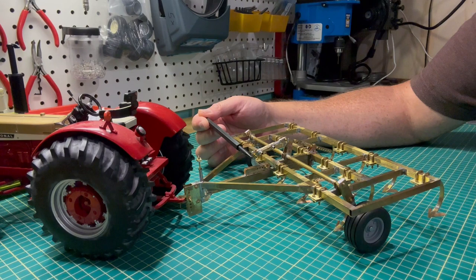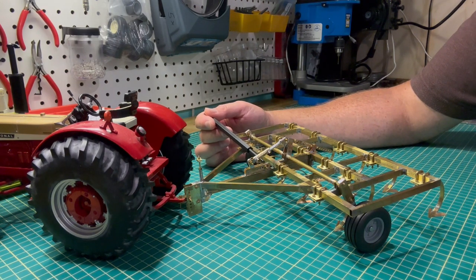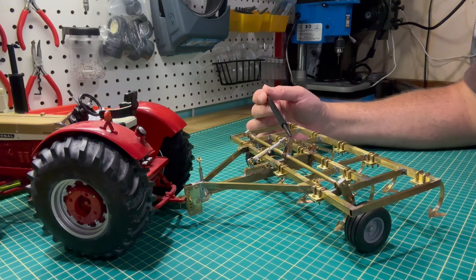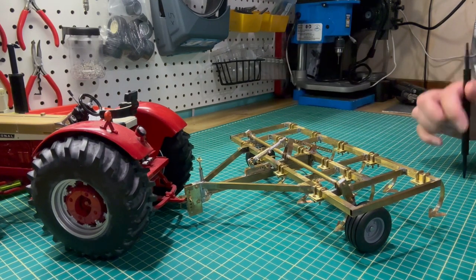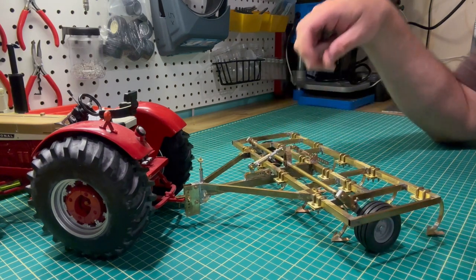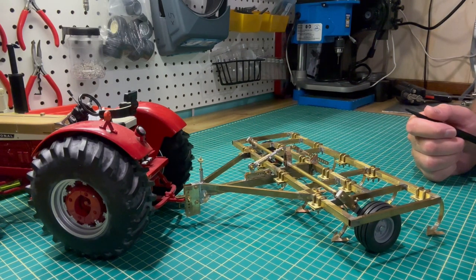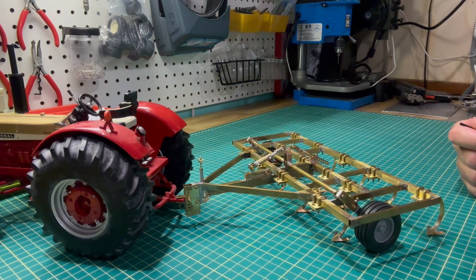To set your level front to back as well as side to side is quite manual on this design. Up here on the hydraulic ram, this is movable — you work with your locking bar to set the optimum height and level. There are several holes on the bottom and you adjust the aluminum arm accordingly. This works hand in hand with the adjustable bar. It's all done with bolts — no fancy locking pins. I'm going to pull this safety bolt right here and lower it to show what it looks like sitting level behind a tractor.